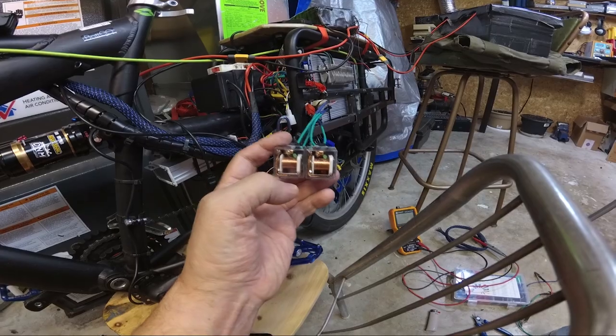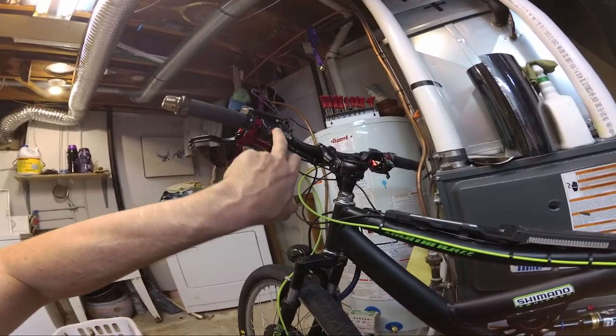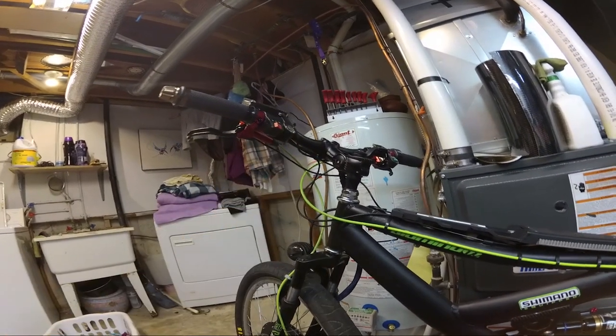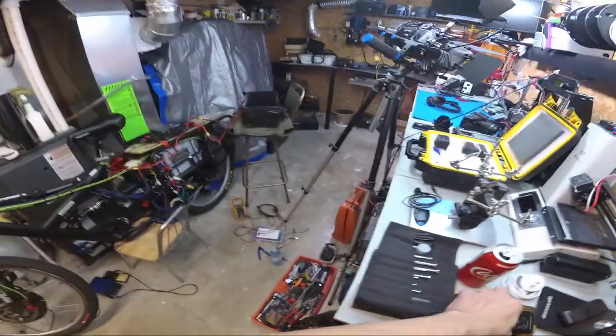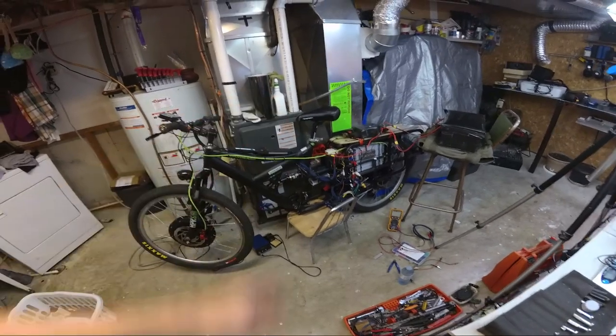This way, each one of these is a throttle — front throttle and back throttle — and you can use it on a three-speed switch. By default when it's in the middle, that's dual motor; that's the front and that's the rear, which I will show you. It took a couple of hours to configure and I'll tuck it all in, and we should be good to go.